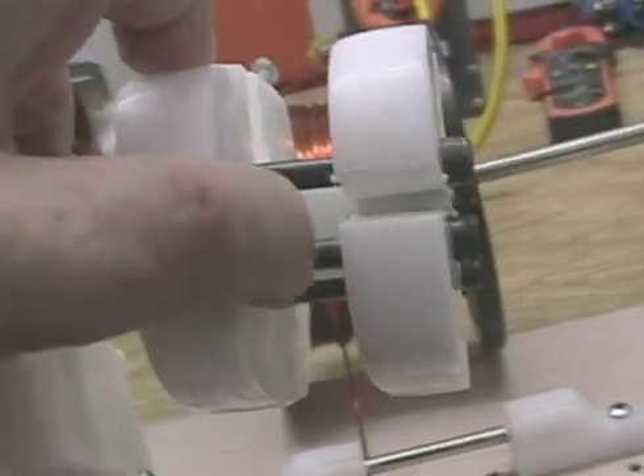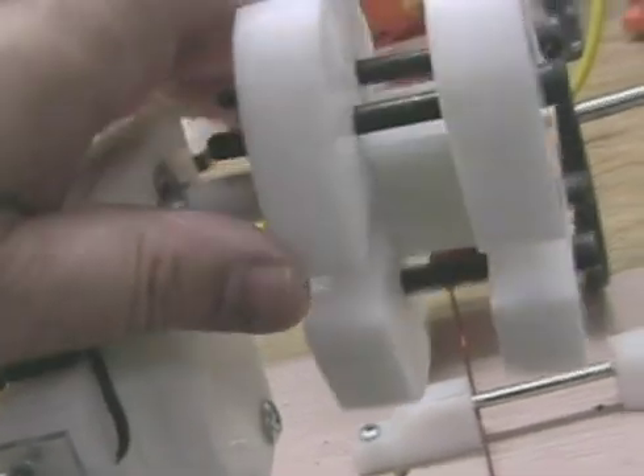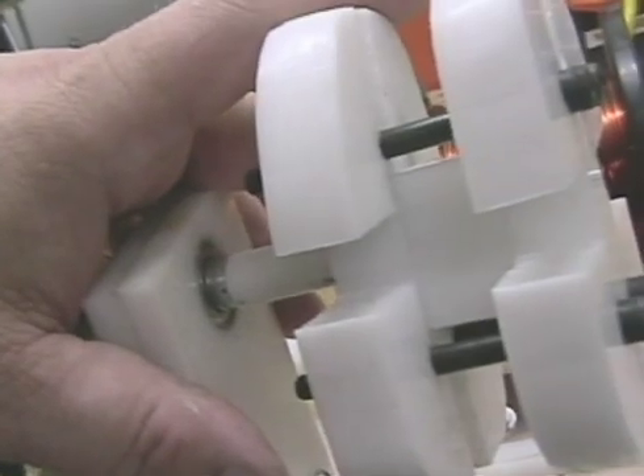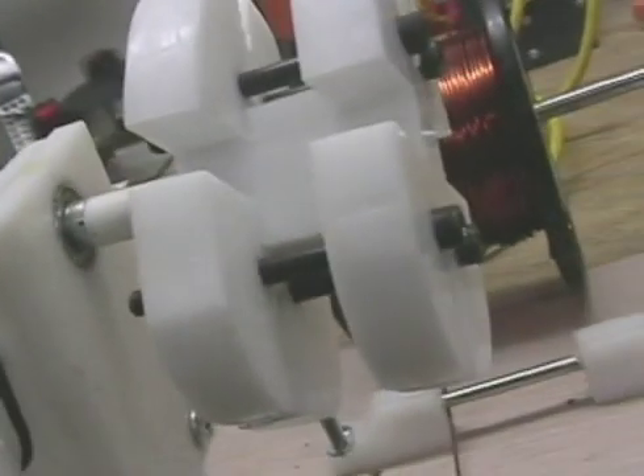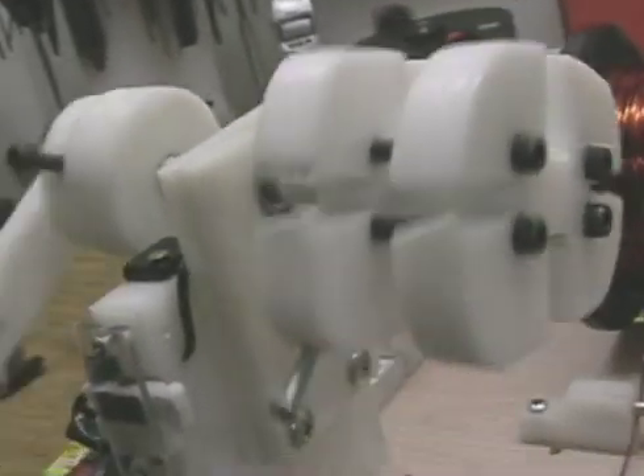You can see the wire comes over this and through this groove. And then the bolts are the support points for the wire. So it means the coil falls right off — you take the bolts out, the coil comes off every time. You don't have to worry about it getting stuck on the center part of the winder that way.